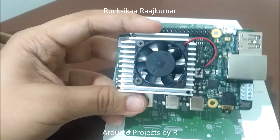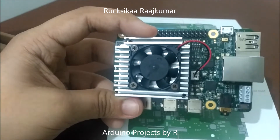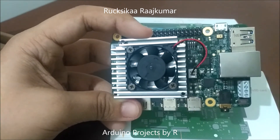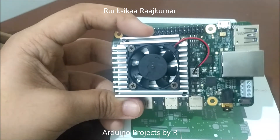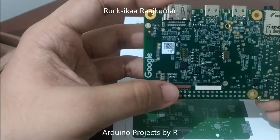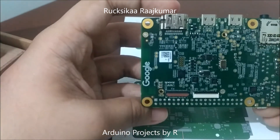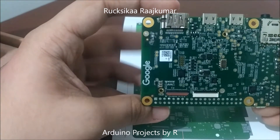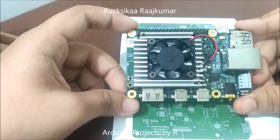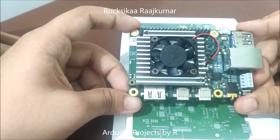You can also use the micro SD slot for additional storage. The wireless connections on this board include Bluetooth 4.2 and Wi-Fi 2x2 MIMO. This board also has a 39-pin FFC connector for MIPI DSI display — 4-lane — and a 24-pin FFC connector for MIPI CSI-2 camera — also 4-lane. You can use the development board to prototype your system and then scale to production using the onboard Coral System on Module combined with your custom PCB hardware.